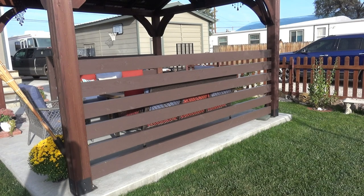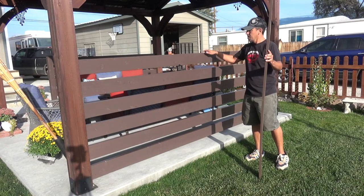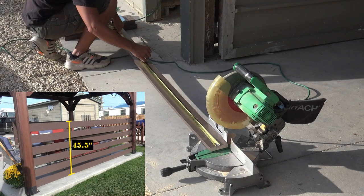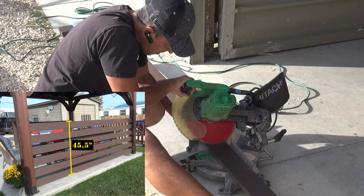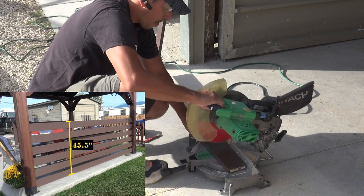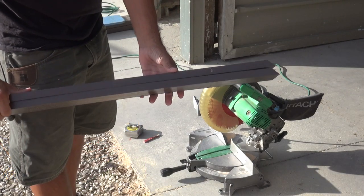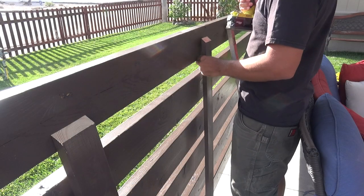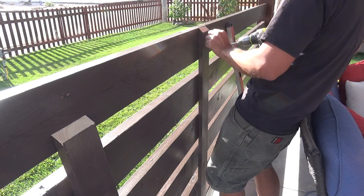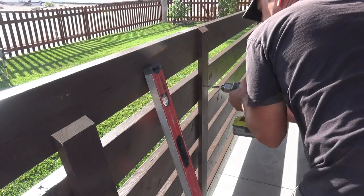This side is just about done but I have a few steps left. This half wall needs a little extra vertical support to strengthen it, because as you can see the boards have a lot of movement to them. To correct this I'll be using some 1x4 boards that will install vertically spanning from the bottom board up to the top board, which measures at right around 45 and a half inches for my wall. I like to have these supports installed within every four feet going across. My wall is right around 12 feet wide so I will install two supports for this side. I also like to cut the top edge of these boards with a 45 degree angle cut, which provides a better appearance. These can be installed on the inside or outside of the wall, spaced evenly across and secured with two one and five eighths inch long screws at each 2x6 board location.